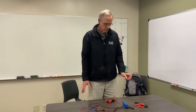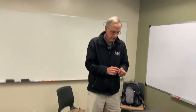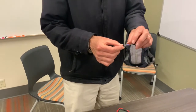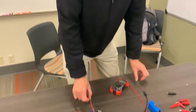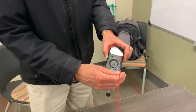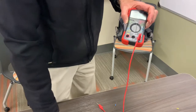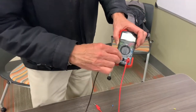To start off in your lab, you're going to measure the resistance of your resistors. The blue tape resistors are approximately 110 ohms, but you're going to measure the precise amount. To do that, take two cables — one cable goes in the bottom right hole, that's where the measurement cable goes, and the other one goes in the common, which is your ground connection.